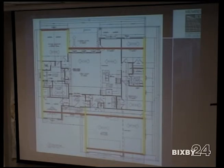Okay, so the first one is I use continuous sheath method. Do I have 4 feet of bracing? Do I have 4 feet anywhere? 4 foot sections. But I don't have that. Next one with continuous sheath, you can do partial credit. Do I have 42 inches? Okay, do I have 3 feet? Okay, so I don't have any section that has any of those. So my next one is, okay, I've got maybe an alternate brace wall panel. I can use the ABW.